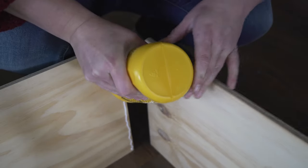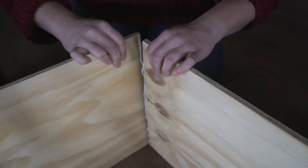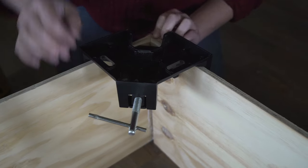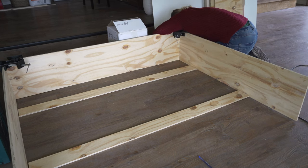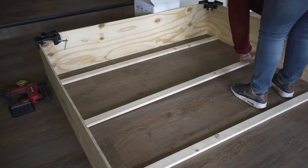While the countertop paint was drying, I could finally start building the bookcases and the middle piece that will go on top of the cabinets. I started with that middle section because I figured that was going to be most of the work. So I made a box out of plywood and connected them with a couple of slats just so that it would stay in place, but also to give me something to nail the shiplap pieces into.